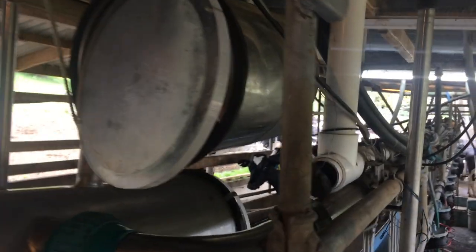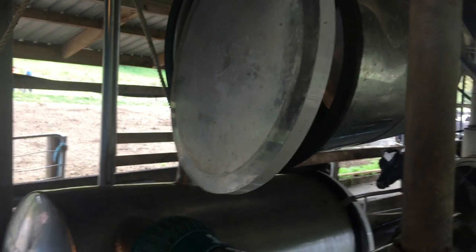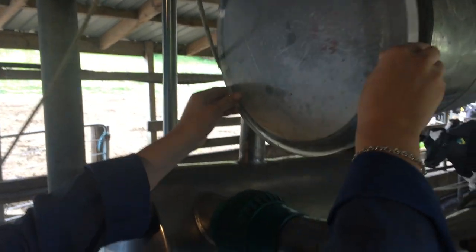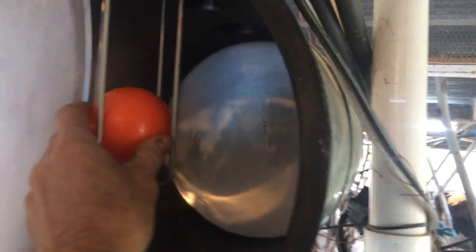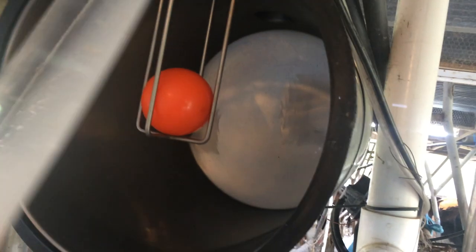So you come over to here now — we still need to get the cows in. We've got to put these things on. This is the interceptor can — you've got to put that on so it doesn't leak. If the receiving can fills up with milk, the milk will get sucked up into here, and then that ball will go up and block off the suction.